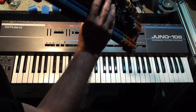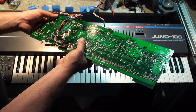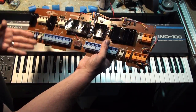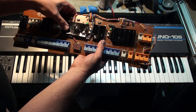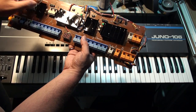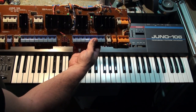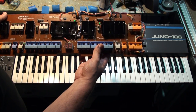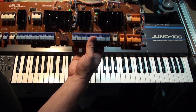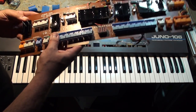An awful lot of work, really, to take what's essentially a stock original board. And you'll notice too, it's actually mirror clean and not covered in gunk, solder flux and the like, because I also give the board a thorough cleaning front and back and remove all the tact switches and replace them, and it takes a really long time actually. But that's part of my process when I do a rebuild, and that's just the way I roll, and I recommend everyone else do it too. Really, honestly, it's probably going to be the only time you get inside the synth in the course of its life, so why not give it the proper treatment, I always say.